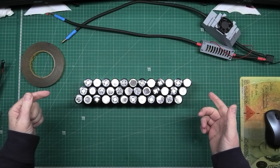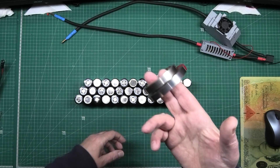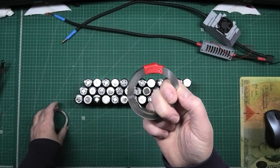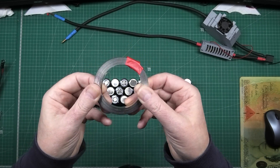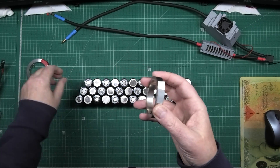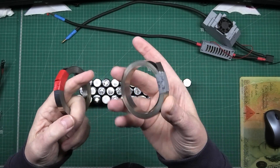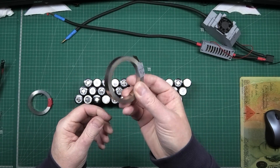What I'm going to do now is start spot welding. There are two different types of nickel strip. This is decent stuff and this is cheap stuff — the cheap one is basically tin with just a nickel coating, so the resistance is higher, it handles less current, and it's rubbish. This is pure nickel — 100% pure nickel. The easiest way to tell the difference: when you're spot welding, pure nickel doesn't spark at all, while the cheap stuff will take your face off. I only ever use pure nickel.